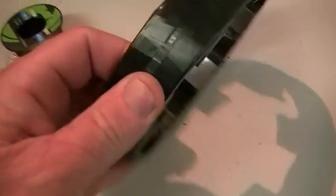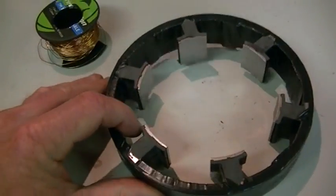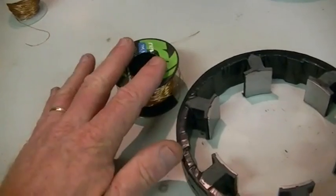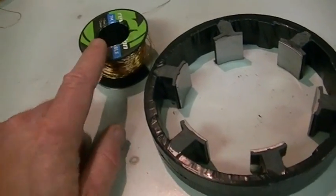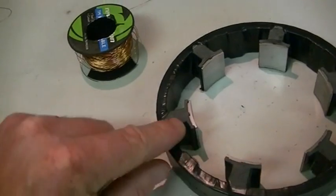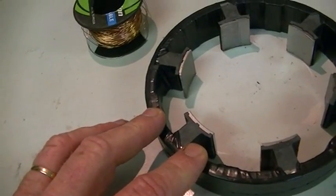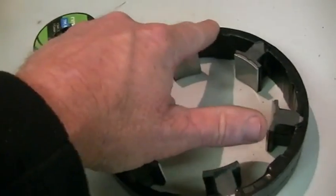Tape's all on and we're ready to wrap some coils. The first set of windings we have to put on is going to be a fine gauge wire, and this is going to be to switch our transistor on and off. When we wrap this, we're going to wrap it around one section — just one layer — miss the next section, wrap the next section, miss the next section, wrap the next section, and that is going to be it. So we'll have every second one with our switching coil on it.